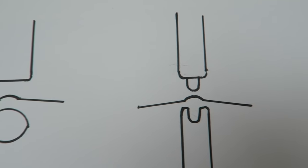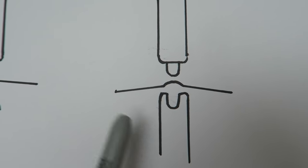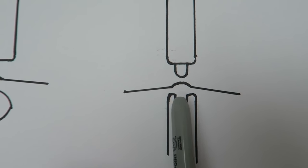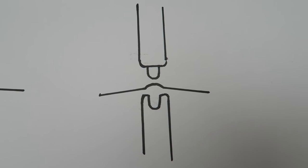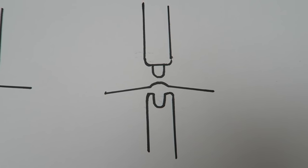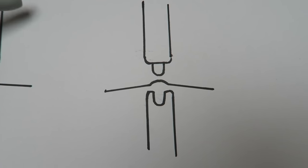So keeping the material in this position with the mini bead facing skywards, we move over to the bead roller. So the bead roller setup with a male wheel mounted on the top and our bead facing the male, we almost turn it inside out on itself. The tension required on the bead roller is probably 1.5 to 2 turns, dependent on which model of bead roller you've got. Try it out on some scrap metal first and get the desired results before you turn it on your project.